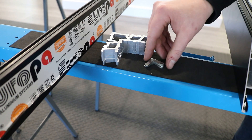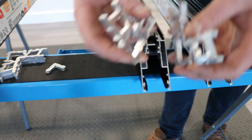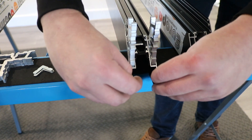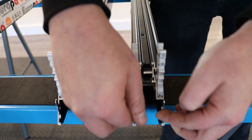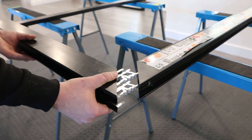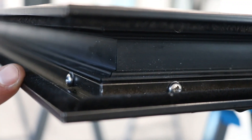When putting the cleats and chevrons in, put one chevron in the top. Apply glue into the chamber before adding one cleat to each side, then two more chevrons in the slots shown. Repeat this for the other mitred sides of the sashes. Silicone all exposed aluminium before putting the corners together. Make sure all the chevrons line up as you put the corner together, then screw together using no longer than 16mm screws. Repeat this process for all mitred joints.